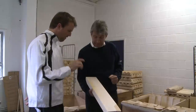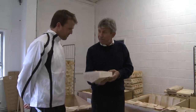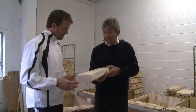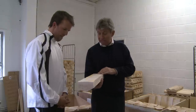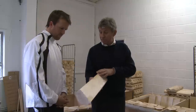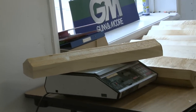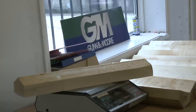How far off the finished size and shape is this cleft now? That feels a pretty reasonably light piece of wood — I guess that's about three, three and a half to four pounds in weight. It'll lose half that weight in wood by the time it's shaped. Let's just double check it on the scales. Yeah, three pounds ten. Spot on. So when the handle's in it, a rubber grip, stickered — that'll be about two pounds ten ounces, which for a good size bat will pick up really well. I'll have that one then. I think you should.